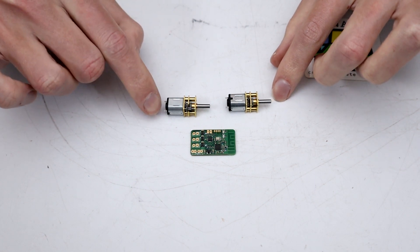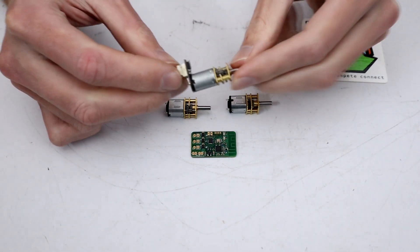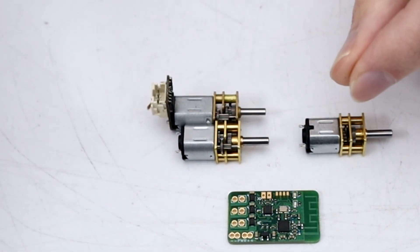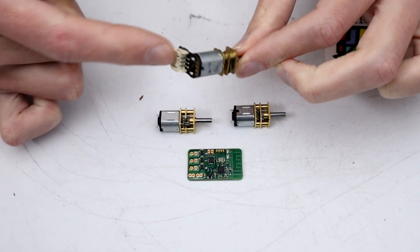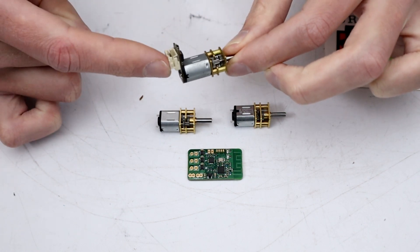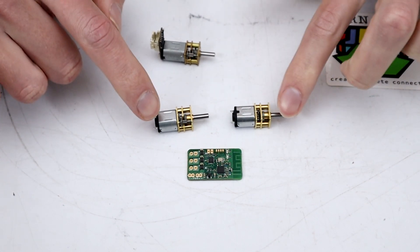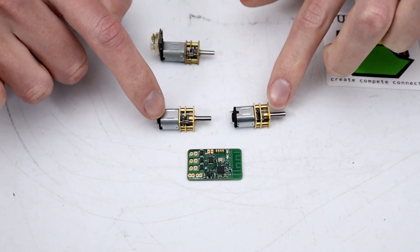These N10s are slightly smaller and slightly lighter than the N20s that I have been using, which are these ones from DF Robot. They have an ESC on the back of them, and as you can see, they are slightly longer and slightly heavier. I don't think that the DF Robot ESCs put full battery voltage into the motor — they seemingly move slower than they should for the voltage given. So these are going to be a massive upgrade in speed, not only because they are geared faster, but also because they're actually giving full battery voltage.